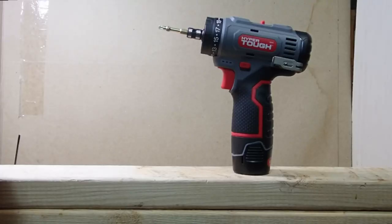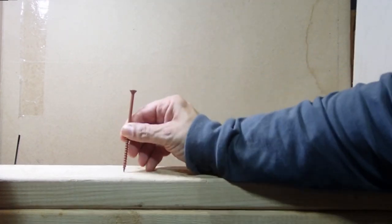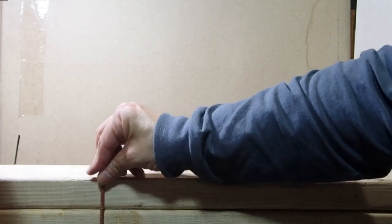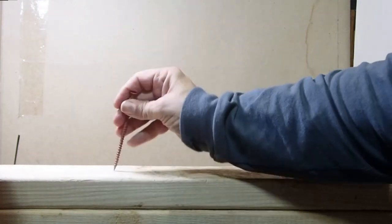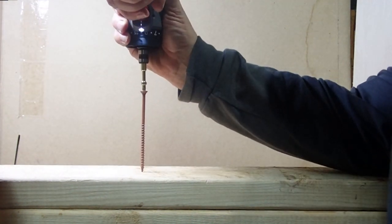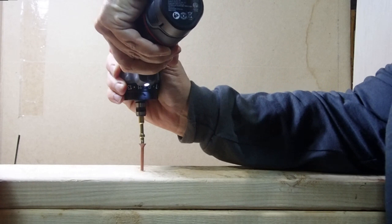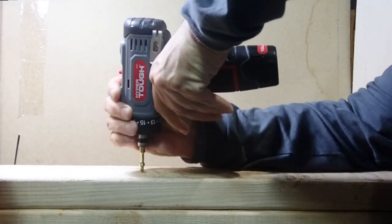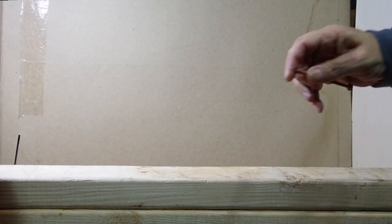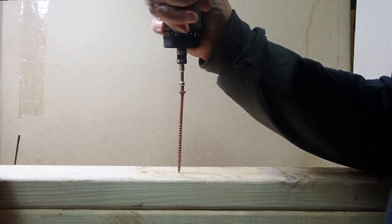This is mainly aimed at the homeowner or renter, so I'm going to try putting in a screw that's vastly longer than anyone would ever need at home — a 3-inch decking screw into a bunch of 2x4s, with no pre-drilling. If it can do that, you should be able to do anything you need inside your home. I drove it in speed number 1, which has more torque but less speed. Let's try speed number 2 — it should be faster but with less torque.